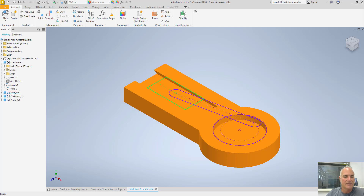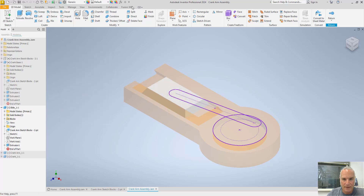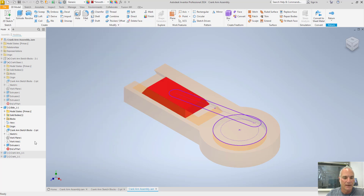For the slide itself, I right-click and choose Edit, then extrude it going the other direction — three-eighths of an inch with the same 30-degree taper, so it will fit in the dovetail just so. I change its color to red to keep things consistent, then return. I don't need to turn the sketch visibility off for this one because it was already consumed when the block was created.